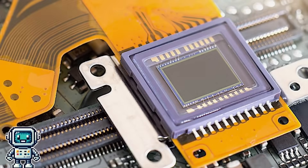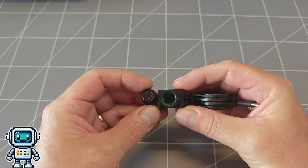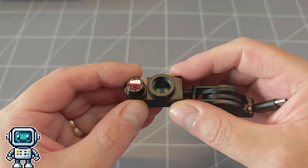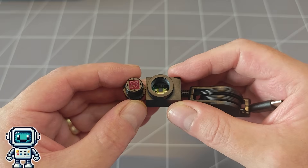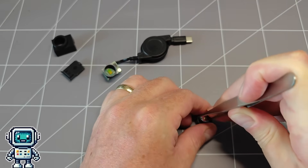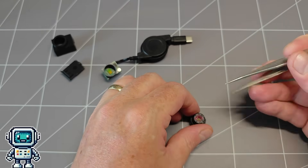The sensors can even see a small way into ultraviolet wavelengths too. If we look at this tiny camera unit and unscrew the lens, we can see the CMOS image sensor inside. On the back of the lens unit we can also see an optical filter, which is used to remove the infrared portions of the incoming light. We are going to remove that infrared filter and allow our camera to see both the visible and the near-infrared parts of the spectrum, effectively doubling the wavelengths this little camera can see.